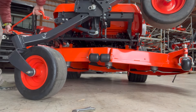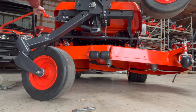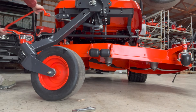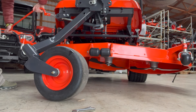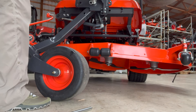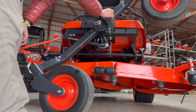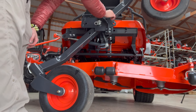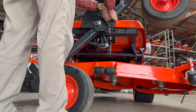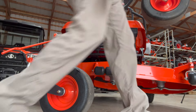That is something we definitely want to do anytime you're crawling under a machine like this. At 1,700 pounds, it's not going to care whether you're under it or not — if it starts falling, it's just going to fall. I always try to use safety jacks, but the good news is with this particular machine, we've got these pins. We're just going to shove it back in that hole and lock it down on the hair pins just to make sure it's not going anywhere. Now that's not going to come back down on us while we're under it, so now we're perfectly safe.